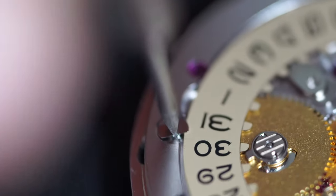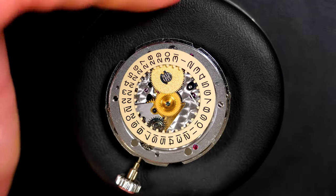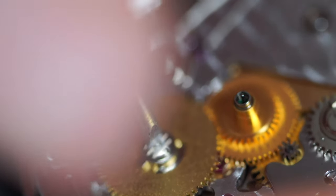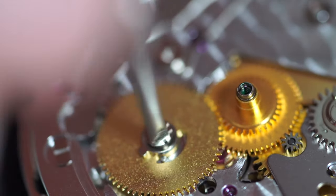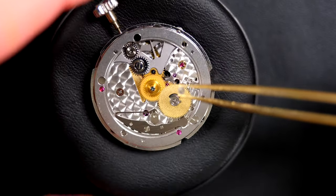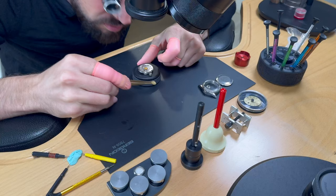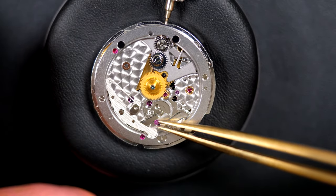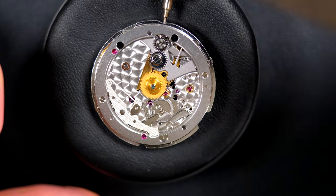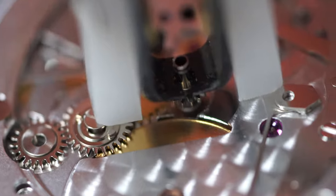Now I'm releasing the date ring and taking it out very gently. Starting to disassemble the calendar mechanism with this screw on top. Taking the wheel carefully — there's a jewel underneath I need to grab. I should have kept the tension off the spring. Removing the hour wheel gives access to the cannon pinion, which is friction-mounted and removed with the Presto tool.